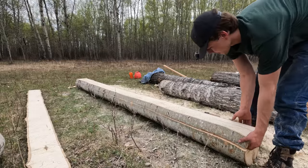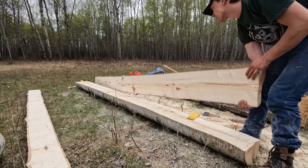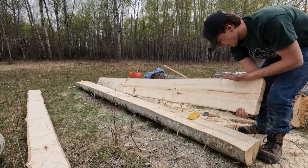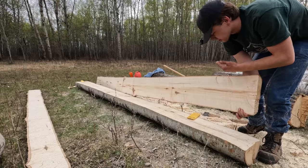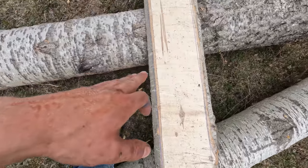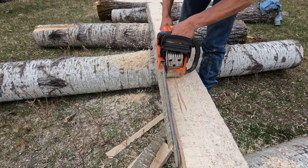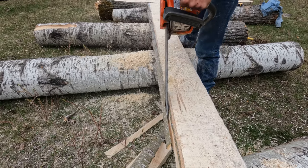First decent slab coming off the mill here, friends. Look at this beauty. She's huge. Now, in doing this, I knew that I just gotta have exactly 4 inches and these edges be straight. So making my guide boards out of this green lumber was actually a touch tricky, because this green lumber, it's gonna want to move as it dries, and I need a perfectly straight cutting surface for the guides.